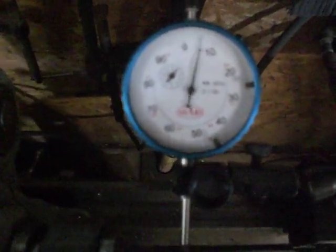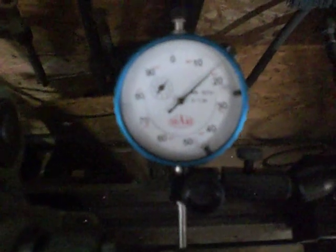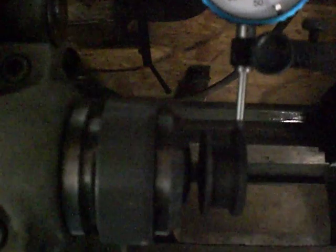There's zero. I rotate this around. The outside rim of the piston is about 20 thousandths out of round. And I suspect the inside one is also out a little bit. I'm going to true that up so that the piston is not scuffing inside the cylinder wall.